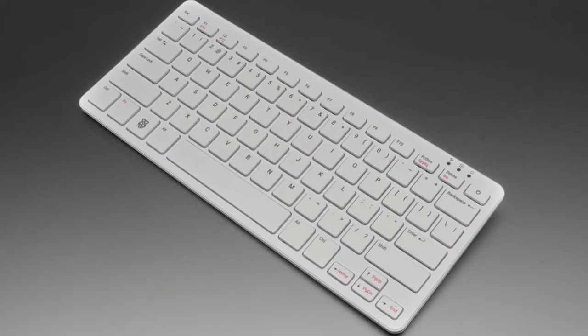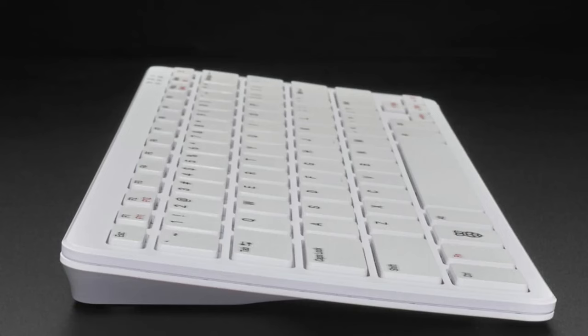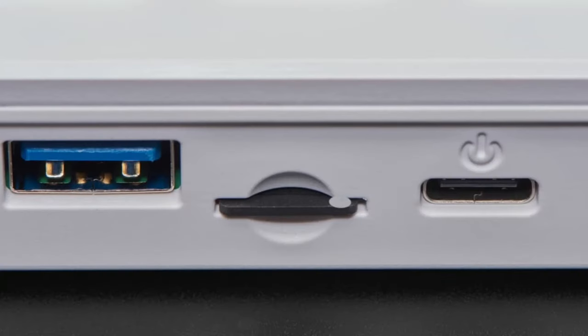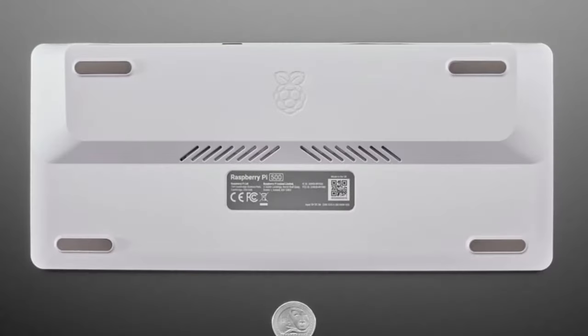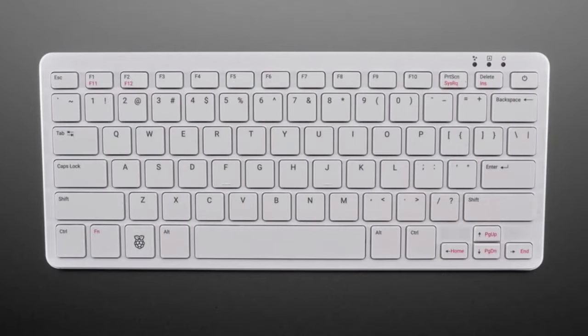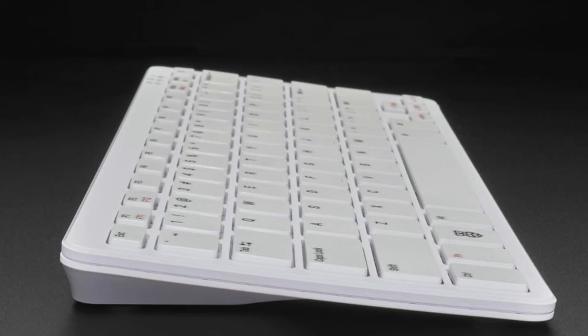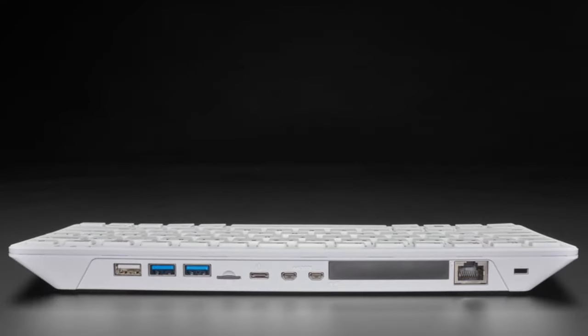Next up, we have the Pi 500 that came in. I think we sold out, but we're going to get some more. This is an update to the Pi 400, but of course, with the Pi 5 chip. So it's like a big update. Much faster processor, excellent USB support, Ethernet, everything's really fast with that new RP1 coprocessor chip. So it's like a big boost and came at the same price as the Pi 400. So the Pi 400 has dropped its price. It still doesn't have a microphone, but it does have two 4K HDMI outputs and some USB 3s.